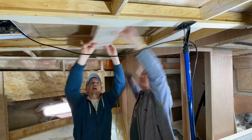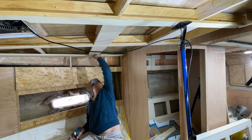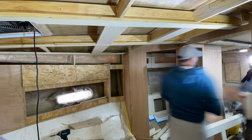So in with a new wider piece of lightweight plywood, checking we have nice tight gaps, and then using stainless steel screws to hold in place. This is just a dry fit, so we will need to remove again for the final bond and fix once we are happy everything fits.